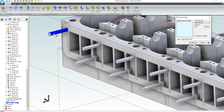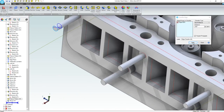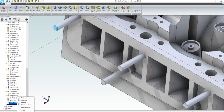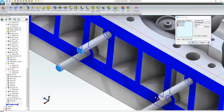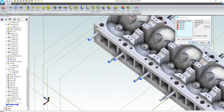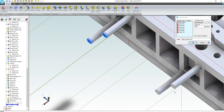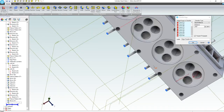And a quarter inch chamfer is pretty high. You can see it'll probably take up the whole. Yeah, I don't even know if it could generate that. Let's try that. It generated with errors, so we're going to edit that. And let's go with something more reasonable, like a 50 thou chamfer. And that looks good to me, so let's actually edit that. And I can add some edges. In fact, I think faces are probably the easiest to add, especially if I can get these faces away from any other faces or edges behind them. So we're adding chamfers, looks good.